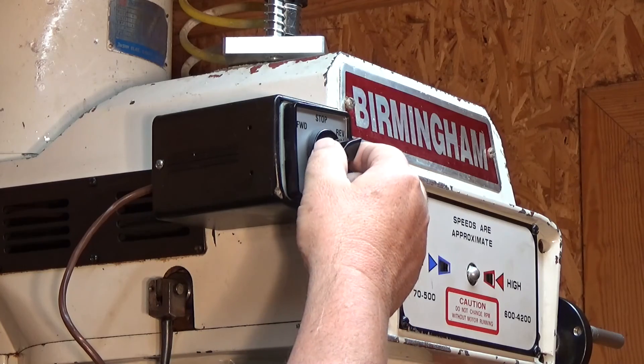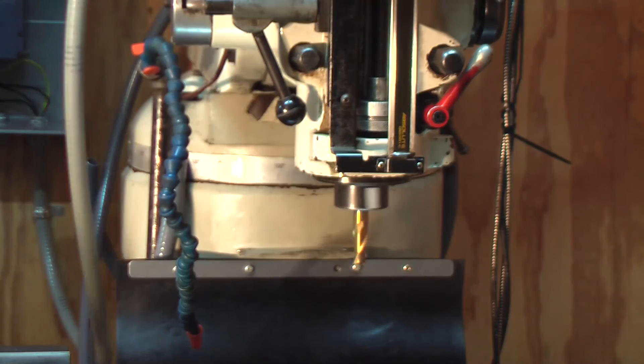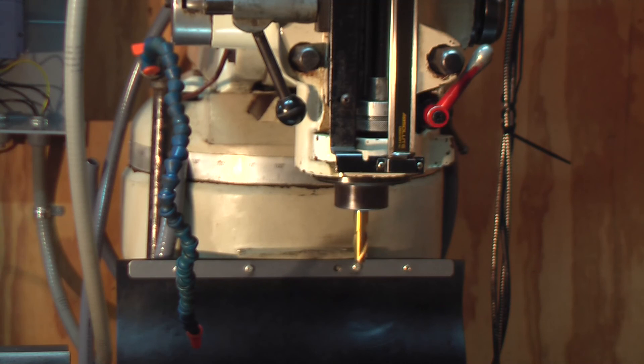I do have it in low gear here, so it's going to be reversed anyway — forward maybe forward. The reverse is forward and the forward is reverse. On these variable speed drives, when you go to low gear, it reverses the rotation.